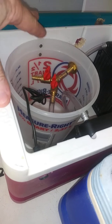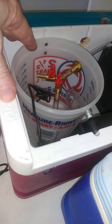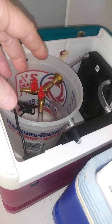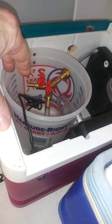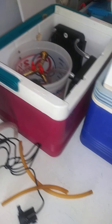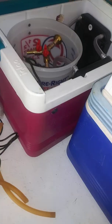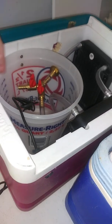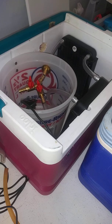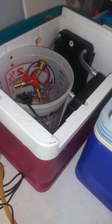I was intermittently running it on high, then medium, then low. The faster you run your fan, the more hot air you're pulling through the radiators, so that's going to melt the ice, or heat the water more, the higher you run it. You could probably run this little open loop unit on that little bucket of ice for a good while. I'm also going to have a drain plug diverter so you can run it indefinitely by filling it with ice, or using a larger cooler as a backup external ice storage tank.